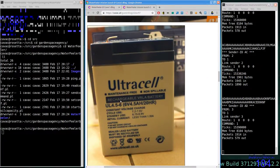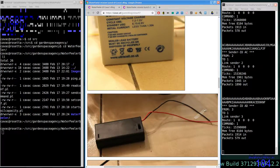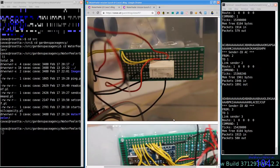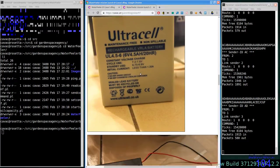This is the battery. It's a classic 6-volt lead acid battery. In theory, it's maintenance free, but yeah, whatever. It's a small motorcycle battery. That's my start stop mechanism. If I want to start the probe, I just wire up from the outside to this relay which is inside, the three wires that go out, the black and two yellow, and just switch the relay.